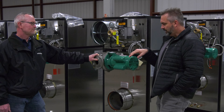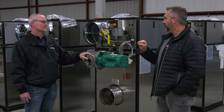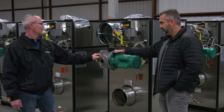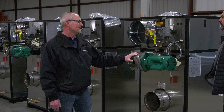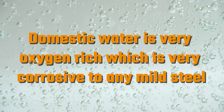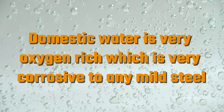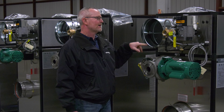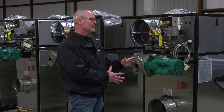Is that a situation because when it's down it starts to rust, or even from a rental standpoint? Even if it's not down, it will collect and rust because domestic water is so oxygen-rich that anything that's mild steel — that oxygen will attack it, it starts to rust, and when it starts to rust it starts corrosion, and the corrosion carries through the water.